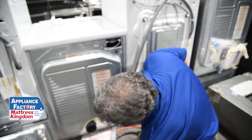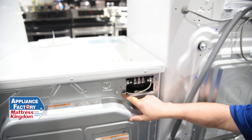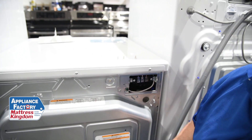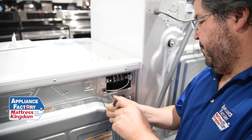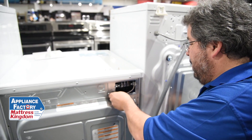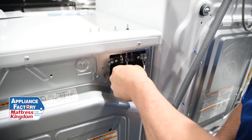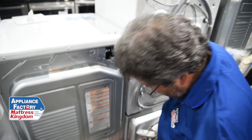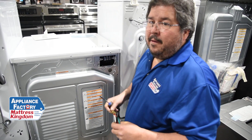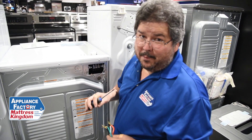If I'm going to use the four-wire, this is where it gets a little more difficult. I need to take off the internal grounding wire — this uses a 5/16th head screw. I'm not going to cut it off; I'm going to combine it with my neutral, basically making it a loop, which isn't going to hurt anything. I always start with my neutral first, so that if by some chance electricity happens to hit this, it has somewhere else to go besides into me — because getting shocked ain't a whole lot of fun.